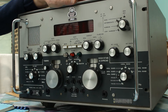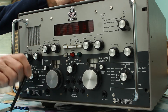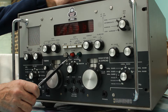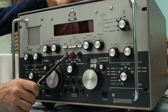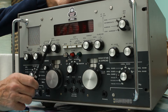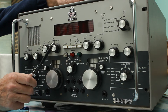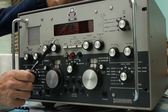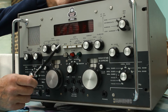High stability gives you the necessary stable frequency to resolve single sideband — not a technique used nowadays because we've got extremely accurate oscillators, but it's very interesting. The oven light here on the front — we always used to joke that we'd cook our pasties on it, being in Plymouth — but in fact the oven refers to a circuit housing an 8 megahertz oscillator, temperature controlled between 60 and 65 degrees C. That is used as the frequency from which all others are derived, making it the most fundamental requirement for stability at all times.